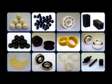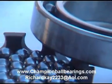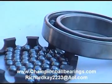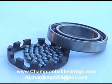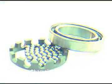Champion Bearing offers both 100% ceramic and hybrid ball bearings. A hybrid ball bearing consists of a metal inner and outer race with ceramic balls. Often the retainer is made from stainless steel or plastic such as Vespel or a proprietary self-lubricating Teflon compound which we call Baroloid.